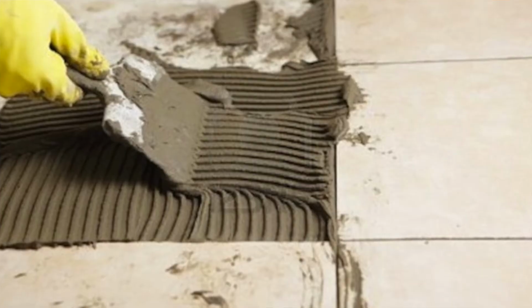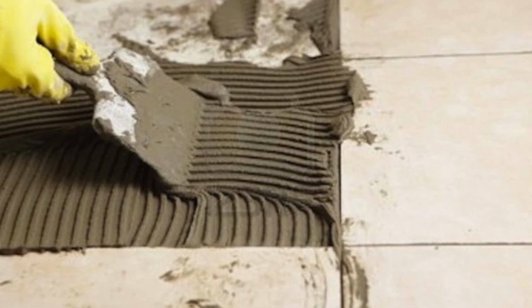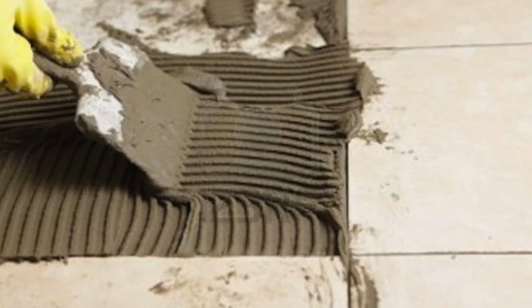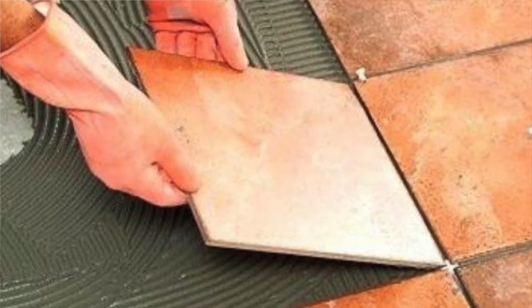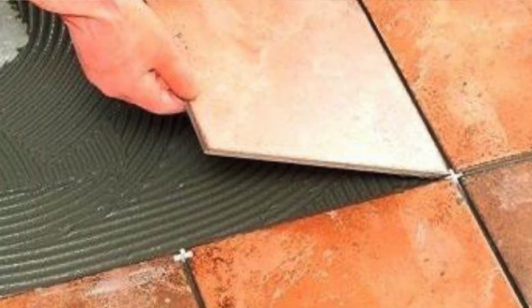In the case of laying of floor tiles, a slurry of grey cement or tile adhesive, both in liquid form, is poured on the floor on which the tiles are installed. The tiles are allowed to rest for a couple of hours so that the base adhesive sets the tile. It is advisable to leave at least 4 mm gap between the tiles for grouting, as tiles expand and contract in different conditions. This is purely a technical method of laying of tiles.